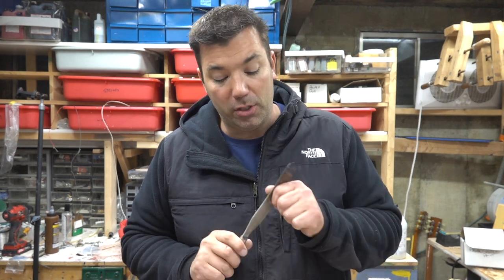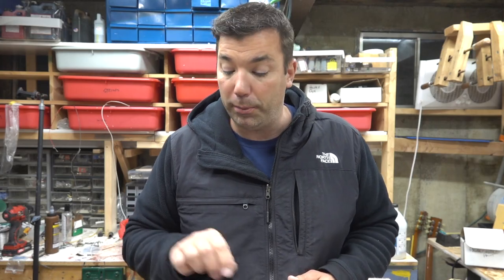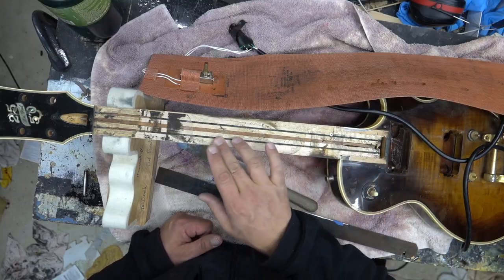That wasn't ideal, but since the fretboard was completely trashed it kind of worked out — the fretboard was cracked and I needed to replace it anyway. I'm going to try a heat knife next time and use that on the spatula to maybe control the heat a little better so I don't burn. I've got to sand some of this out.